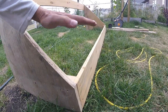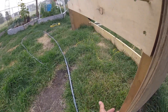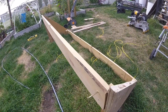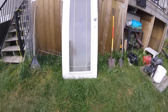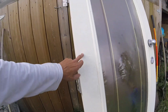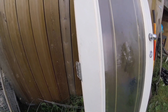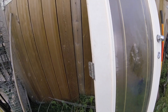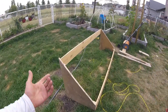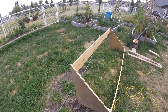That'll come up a little bit more so the door sits nice and flat. I'll do the same with the top, then it's just add another board, add another board, rip the last one on the table saw. One side of this door is white and the other is black — I'm going to turn the hinges around so the white side faces in to reflect light, and the black side faces out to help collect heat through the arctic winter.